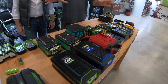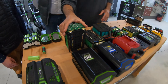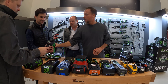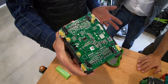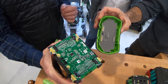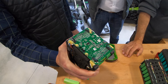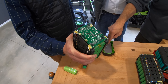These are all the latest versions of these companies' battery systems. I don't see potting, but I see this glossy coating. What is that — is that a protection? Yeah, so this glossy layer is a conformal coating. It's kind of like a level one of protection, whereas potting is more of a level two or three. This is mainly going to protect against moisture and dust a little bit. It's a very thin layer, so it could be more susceptible to cracking over time, whereas the potting is really a solid layer of rubber giving you a lot of protection — not just against moisture, but vibration. So this is actually poured on.